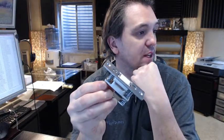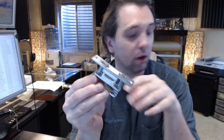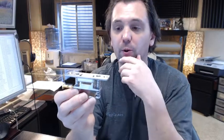These are installed when you're doing a 161 strike or a T strike like this. That means it's typically going to be in the edge of the door where you would otherwise install a standard lock. You're probably going to have a pull plate or dummy trim, or flush pulls or some sort of hardware. This would be installed in the edge.